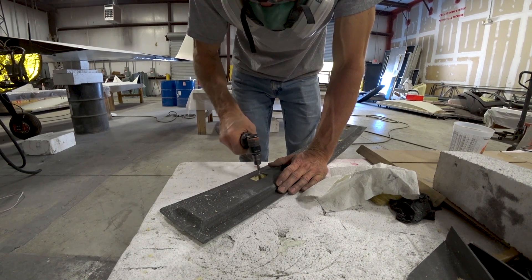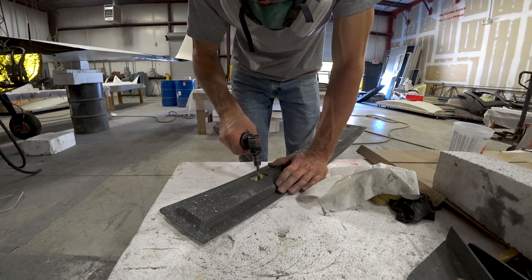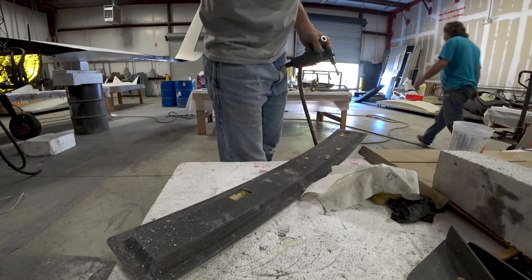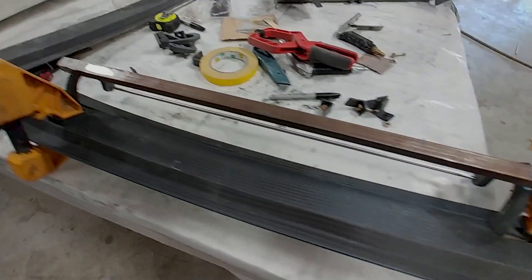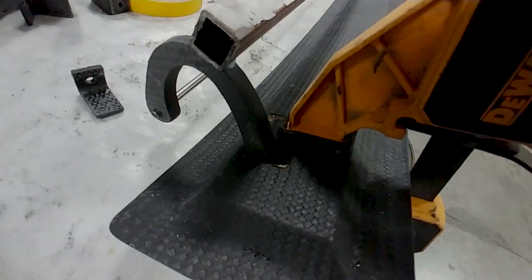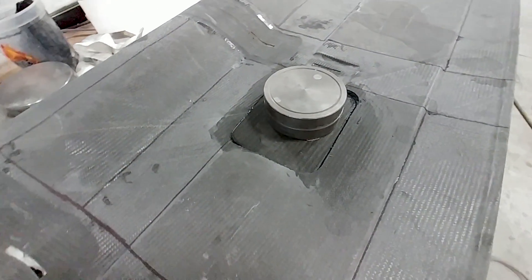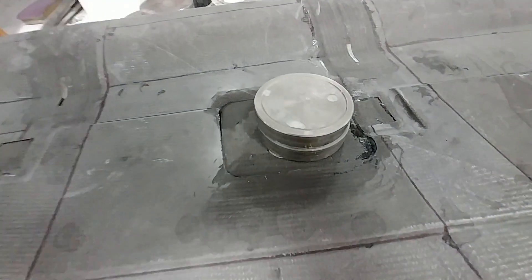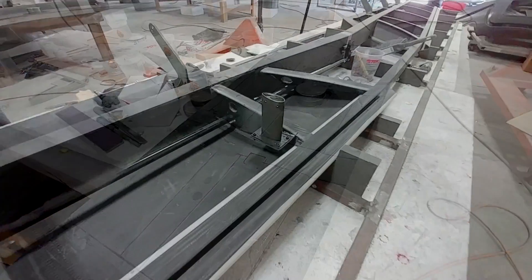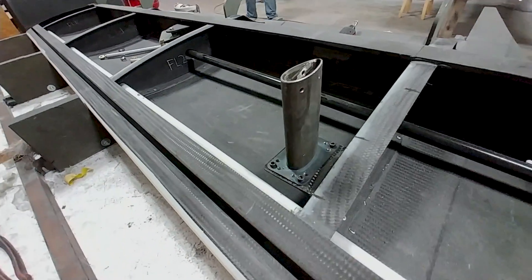Needless to say, I got covered in quite a lot of carbon dust — I had my mask on as you normally do but still get itchy. On the second go-around I've got the hinges clamped in place and five-minuted the little alignment tube to keep the hinges aligned, then I take out the rod through the hinge points and put that in. You can see Jeff is now putting in the little flanges on those openings for the lower skin of the foreplane. There's also the mounting for the pitot tube — you can see it just mounted to one of the ribs on the bracket.